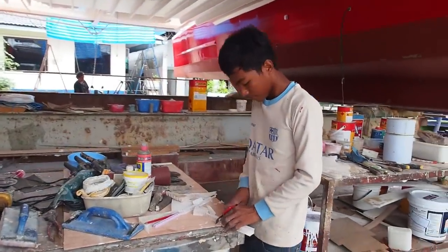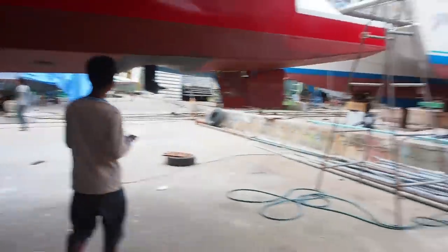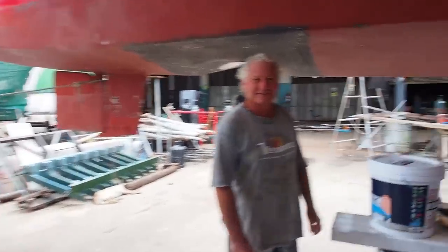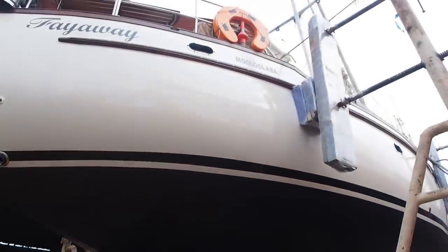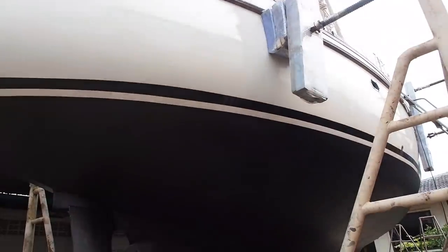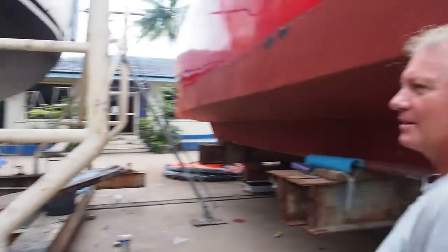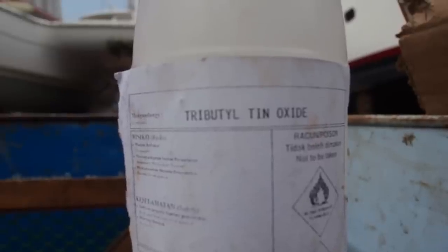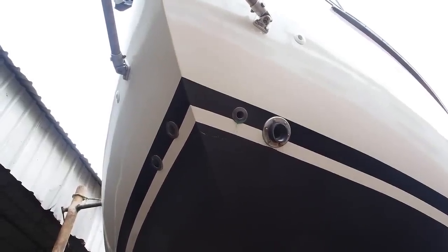This is a typical scene in the boatyard — we've got the little Burmese workers working hard whilst the owners just sit around and chew the cud. We're supervising. Come on, show us your antifoul. Look at this — blackwater line. Tell us about the antifoul, what you put in it. Tributyl tin at 3%. It's supposed to be very good — very illegal anywhere but Thailand or Malaysia, so we're going to try it but it should work. Have you got the bottle left? No, I threw the bottle away in case someone saw it.